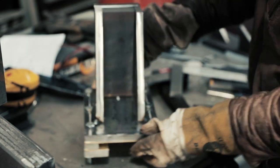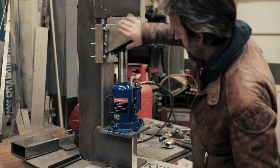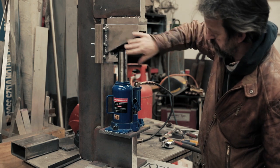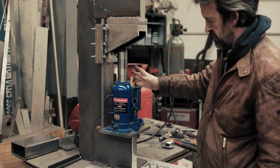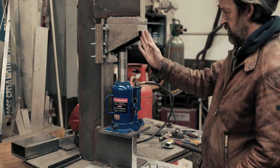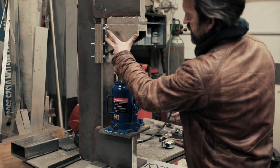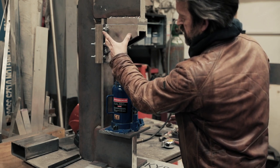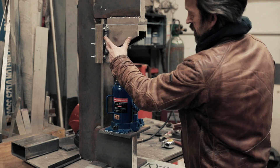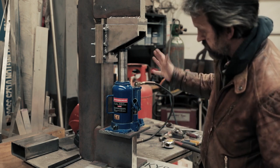So that's them welded up and I've just dressed the sides and the front - top plate welded, the bottom jaw is all welded up. Now I've sat the jack in place and I'll get this plate welded in place. I've made sure the jack is centered - I've kept it further in because this is eight inches but most of the tools I'm using are six inches, so I'll put it in the center of that. Less strain the further in you go. I need to drill the feet and get them welded on - we're not too far away.